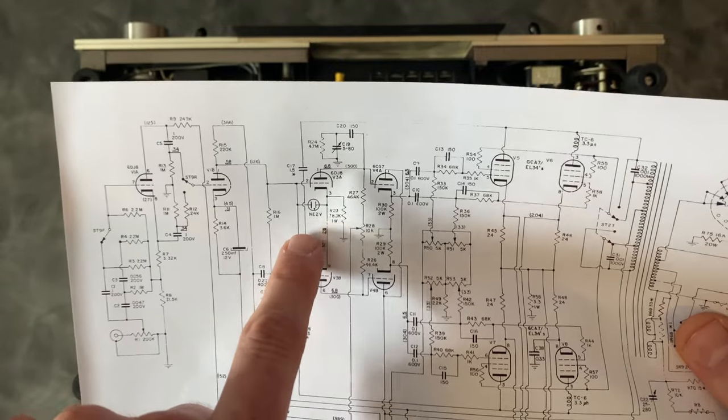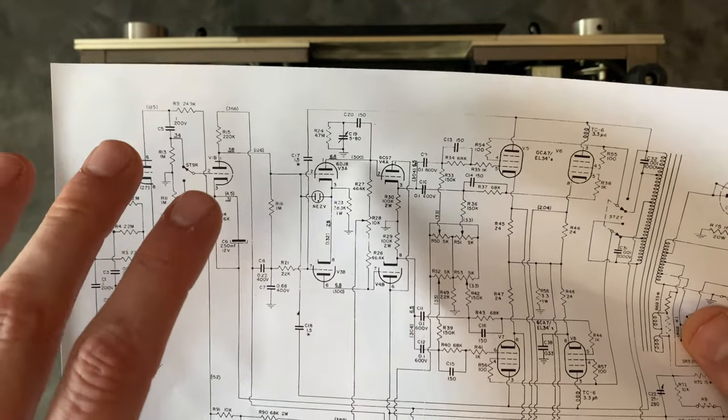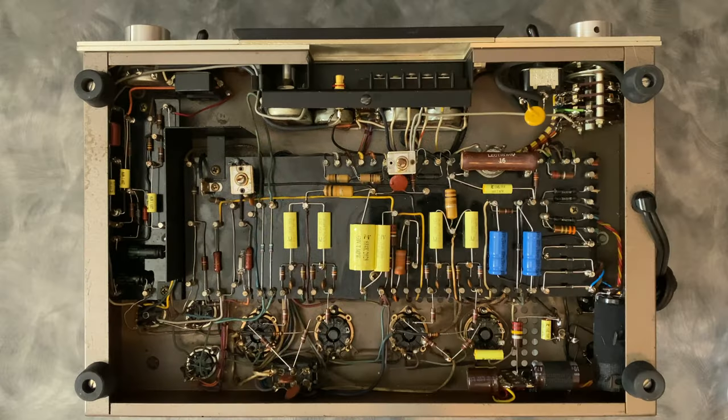So what this neon does is right when you power on the amplifier, it turns on and then fades slowly over about 2 seconds, and then the amplifier is back into its normal operating condition. So that neon gets replaced there just for good measure, but I'm sure the originals would last for years and years because it only gets used when the unit powers on.